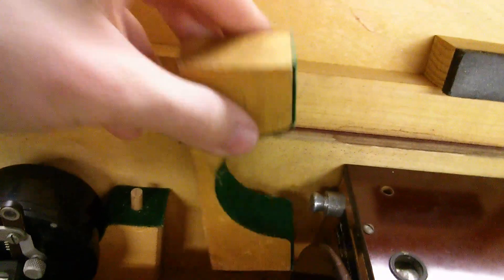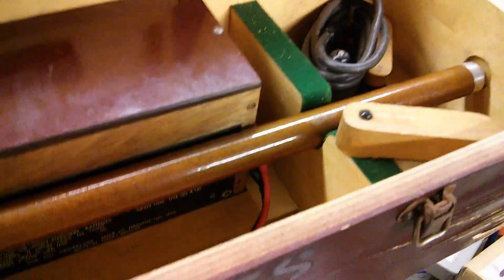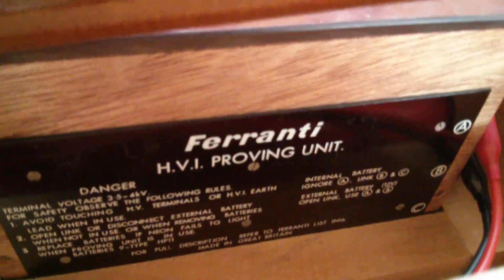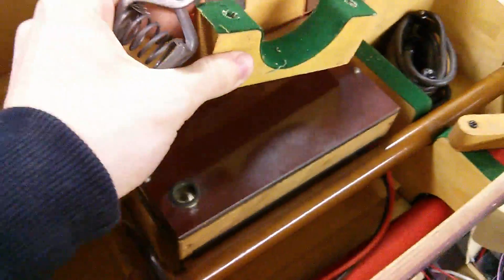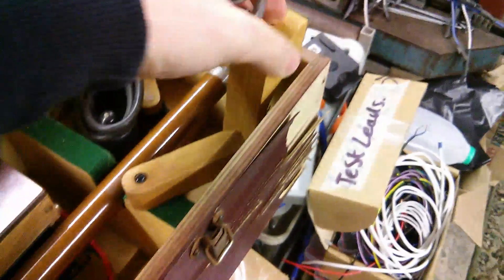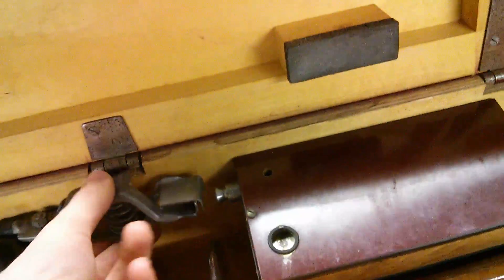It's got one of these carry cases with transportation rackety and stuff - that's to hold it in place. It's designed to be taken in the back of a van around the country, bumpy lanes and all that. It's got the HVI proving unit in it, and that's made by Ferranti as you can see there. I'll actually demonstrate that working now. It's got places to bind onto and test, so I'll take the earth cable out - that's the clamp there - and connect the earth clamp onto there to prove the earth of it.